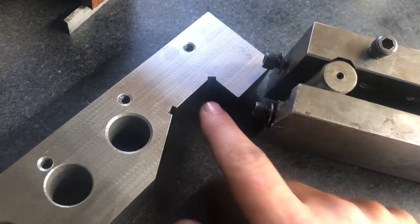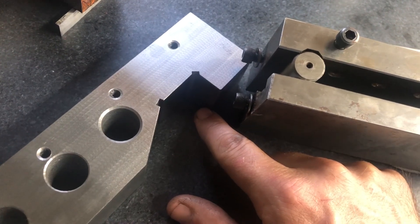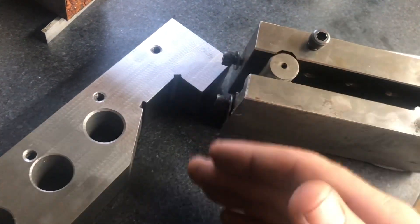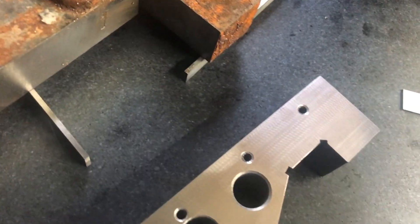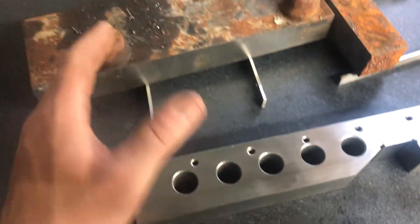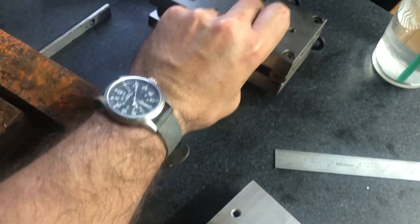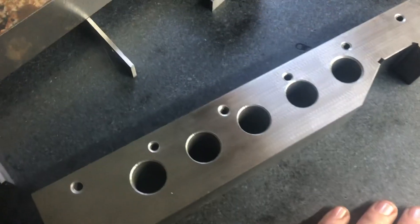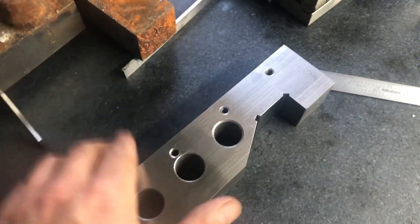With this style, if I don't agree with it and I want to take four tenths off — or even a thousandth — all I gotta do is unscrew that, set it up on the dresser wheel side, grind it, take off whatever you need, double-check the measurements, throw the pin in, and set it. That's why I like this style. The holes are just to lighten it up, although I'm pretty sure it's the same weight as when I started. I do quarter-20 holes in everything — that's what all my pallets and sine plates have — because I'm in the United States. The metric system is great, but the only thing you can't measure with it is freedom. Quarter-20 here; substitute M6 if you're over the pond.